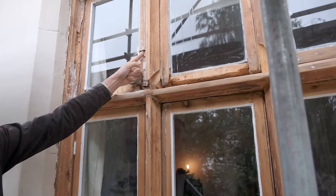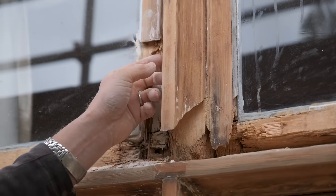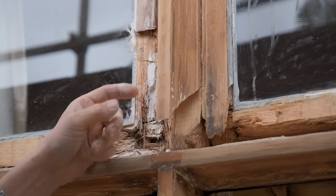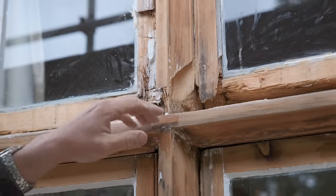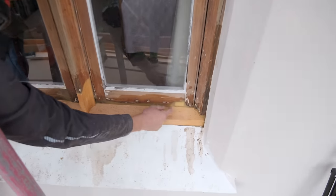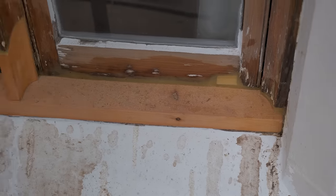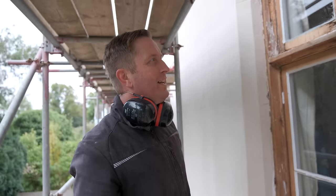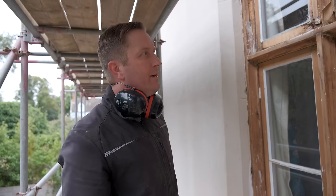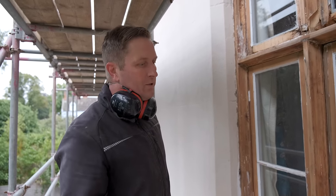You can see in there — it's quite right to take that out, you know it's rotting in there. You need to see what's behind things so that you can treat them properly, otherwise you're wasting time. In some places where we've got deep holes like this, I'll put pieces of timber — similar to what I've done down here — just to bulk it out really. All we're trying to do is bulk out the resin repair. It really is a fantastic job, really good for a long time to come. That's all we're trying to do — just preserve what's there.